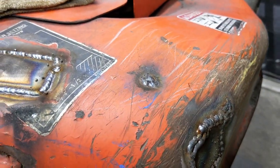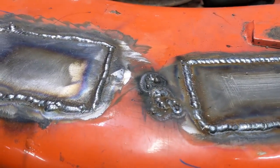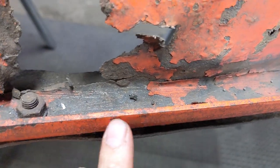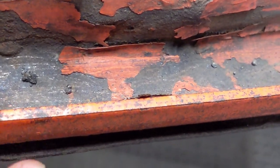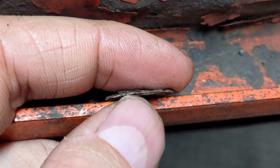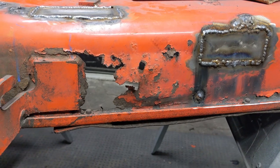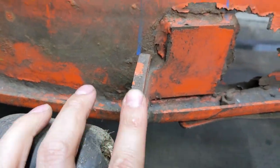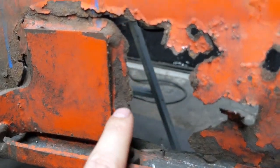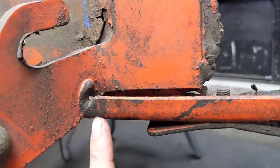I now have all my smaller patches welded, including some of the smaller tack welds. This whole deck is eighth inch - that's how thick the steel is. What I've tried to do here is get a piece that's rusted away - you guys can see that's the thickness of metal I'm welding to in some areas. It's nicer to weld to nice thick steel. This section here is like quarter inch thick - real nice thick steel. If I can trim this up with the plasma and trim the weld off, then I can re-weld to this.